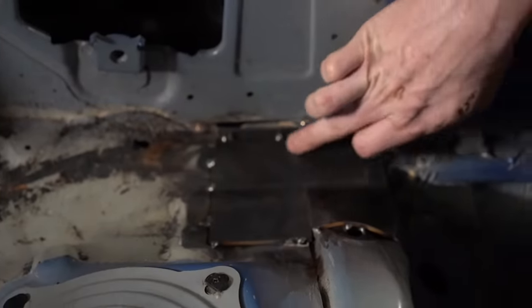This is first attempt. So yeah, you can see where we measured all of our points on the chassis, and that we put the bends in the tube right where we wanted to. And this is what the result is. The 350Z is a bit odd, but we have to give a lot of head clearance here because the chassis actually goes up and then down at the front, where in most cars, the main hoop can be the highest point. Not the case in the 350, but it's okay.